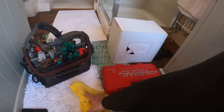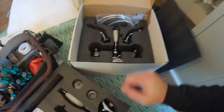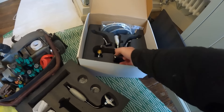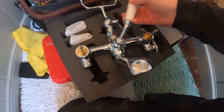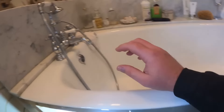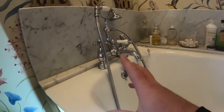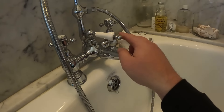They're going for a fairly similar telephone tap. With these high-end taps, this is a Bayswater London tap and they're just made so, so well. It's a really nice tap — the throw on it is lovely switching between shower and taps. It will sit pretty much similar in style, but this one is knackered and it leaks. So I'll switch these lever valves off, get the nut out the tap, and undo the flexes.